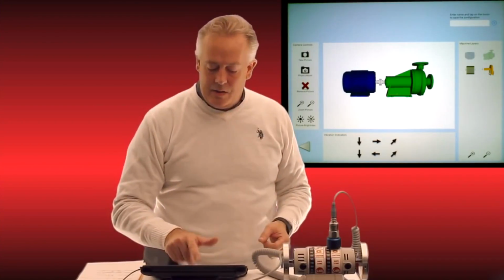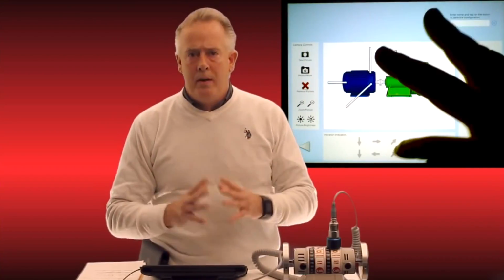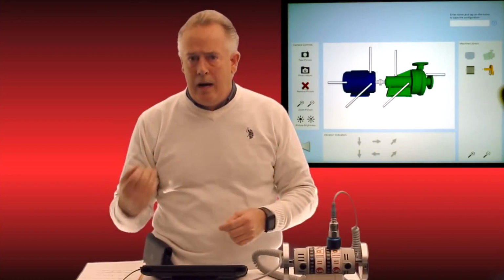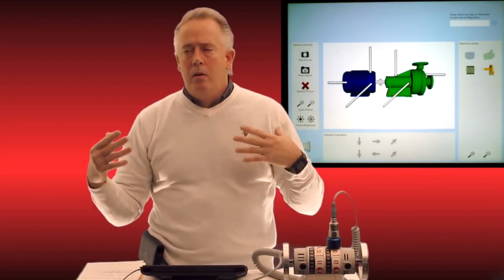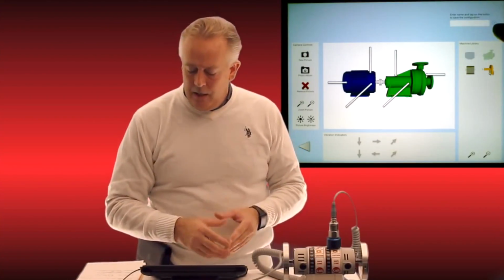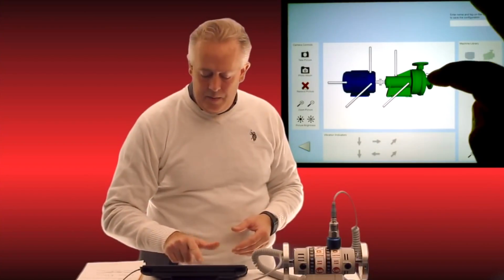And now I can just tap on these arrows, and it immediately puts them right in their appropriate places for vibration measurement, listing them out at H2, H1, wherever their appropriate measuring points would be. But another level above that, what if our assets aren't something that's included in our sample motors and pumps that we have here? So what we've done for you, if I just pull these back out and pull these arrows away,